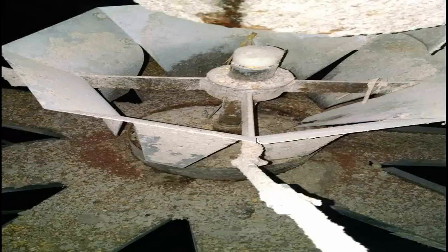This is an example, let's say, after years of abuse as well. The leveling band, as you see, was all the way down. This guy had this spreader for 7 years and never cleaned anything out, left that leveling band all the way down, which is set that way during shipping so we don't have any damage. When it was installed that way, the customer never cleaned it out. So you can see the FM built up on the chutes. The spreader would not perform at any good level at this point, so we need to get that stuff cleaned out.